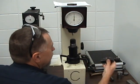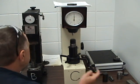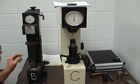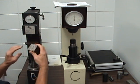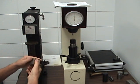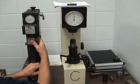Okay, so that's very, very hard. This is probably a piece of O1 tool steel that we've been working with, so that's about right. Okay, now we're going to check something on the other hardness tester that's set up for the B scale. So we have our flat anvil in here, and we actually have a ball penetrator in this one. So it's a larger indentation. So we'll find a nice smooth surface here. Right there looks very good. So let's lower it down, and we'll do the same thing on this one.